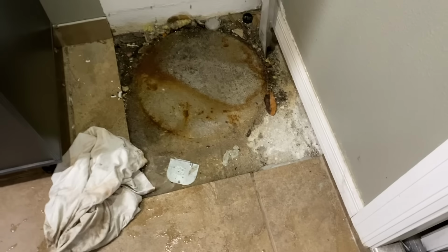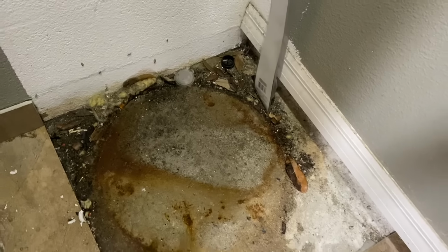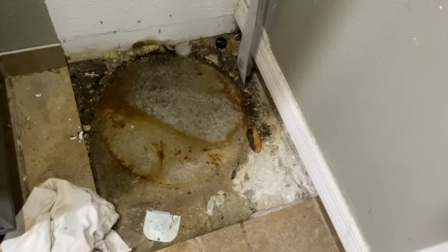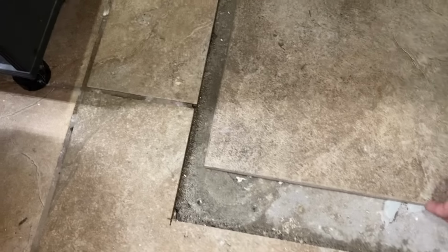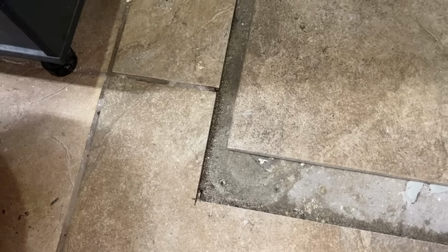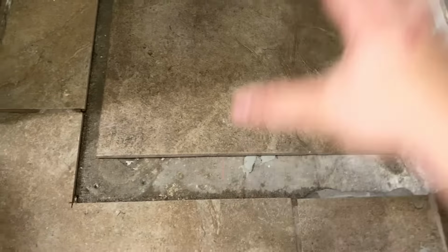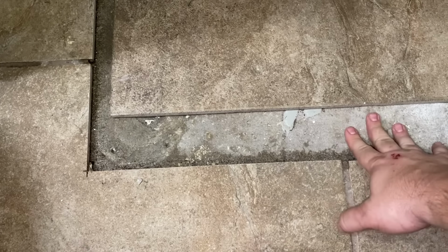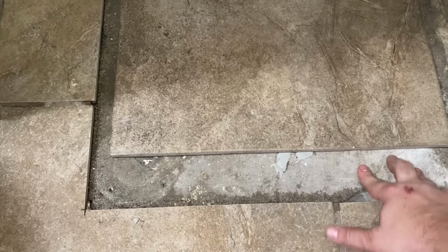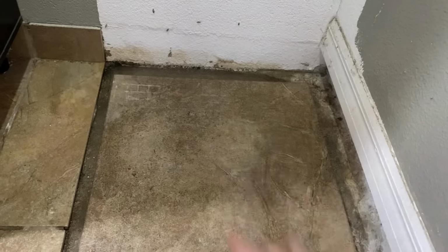Before you put your new water heater back in the old spot, if yours is like mine, I need to clean a lot. So clean all that crap out of there, get all that moisture out of there first. You don't want that sitting on that metal tank. Alright, I dried this out as much as I could. I actually had one leftover tile in the garage that I just stuck down with some VersaBond. So that's where the new heater is going to set. And then this way I don't have to worry about the moisture of this garage floor. We're in Florida. This is on a mono slab in the garage. I don't have to worry about the moisture of this floor getting into that metal little layer of protection there.